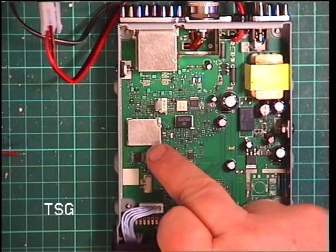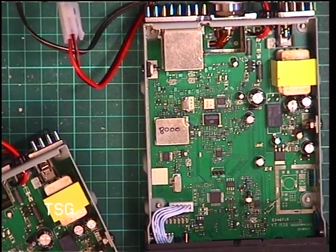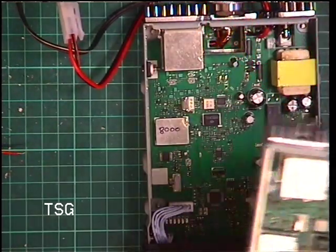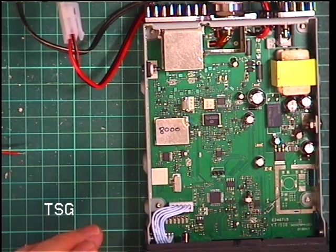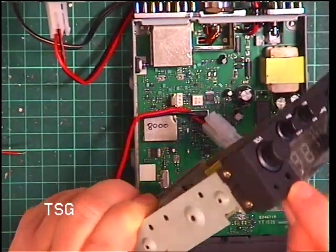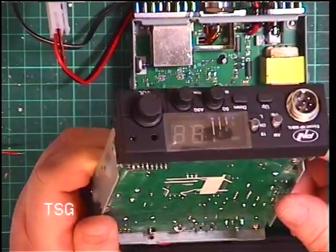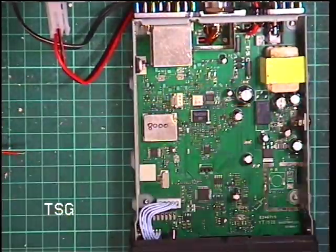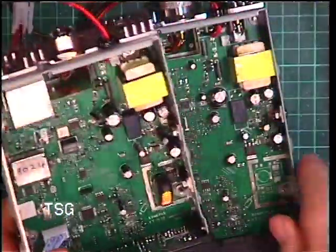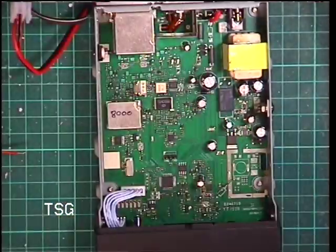I need to get a marker pen and put somewhere on screen what model each is — I'll pause the video for that. So this is the 8000 model, there's the 8001, and there's the 8024. What's the difference? On the 8001, you get this Kenwood-type socket with a 3.5mm and 2.5mm connector, and they sell a Bluetooth dongle which plugs in there for about £20, giving it Bluetooth. The 8024 is the same as the 8000 but has an extra circuit — a 24V regulator — so it takes 12 or 24V, it doesn't care.